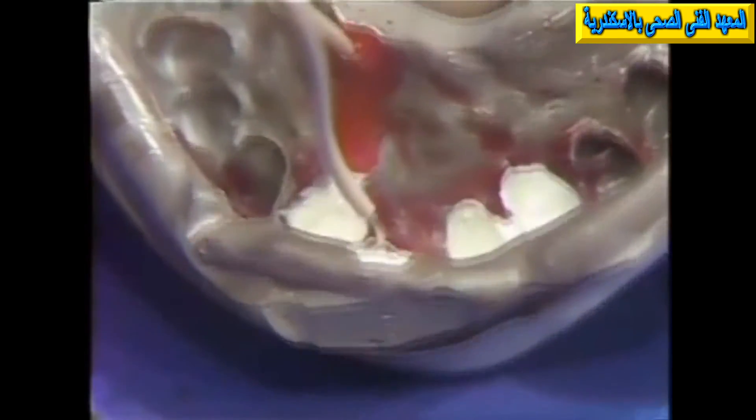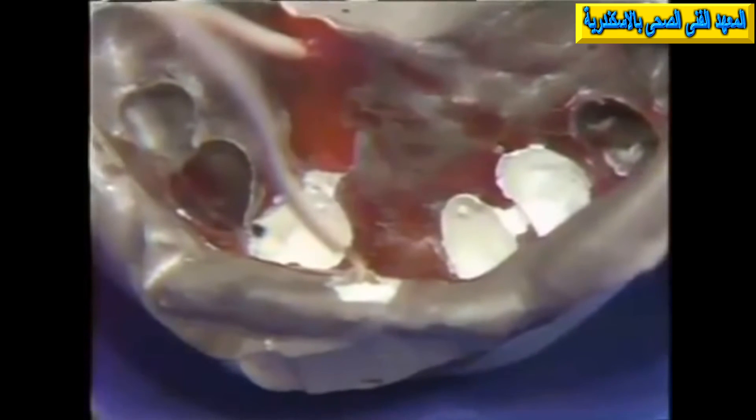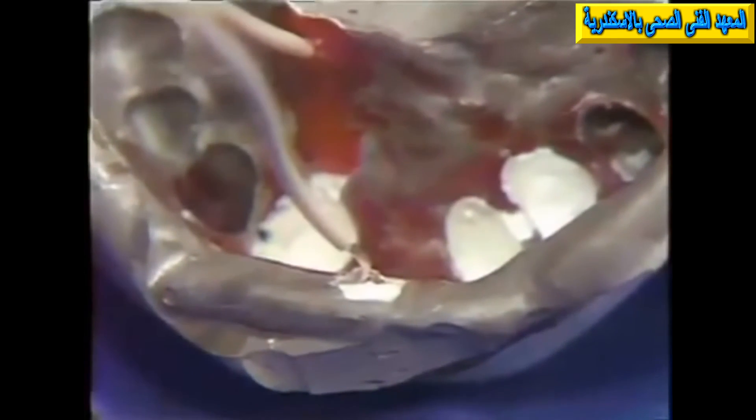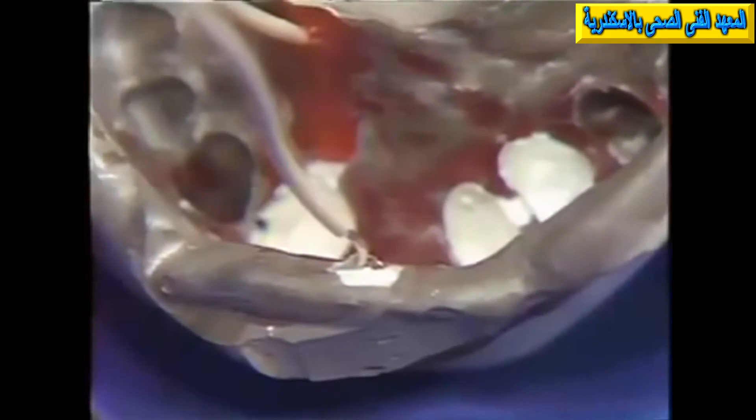After this is done, we'll again return the impression to the tank and plate for an additional eight hours, or until we've built up a thickness of approximately one-half to three-quarters of a millimeter of plate. It's necessary to have this thickness, otherwise the silver plate has a tendency to fracture away.